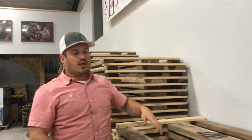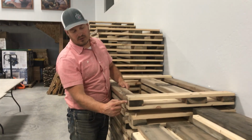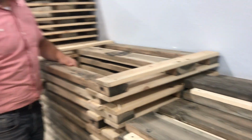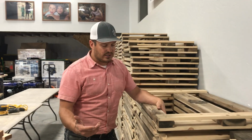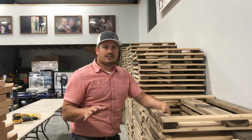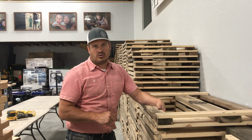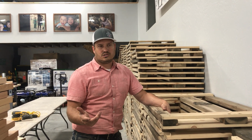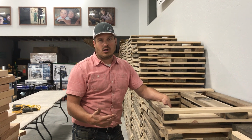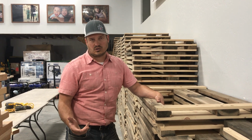Okay. The other thing I would do when you stack these is, you can see here I put the dowel hole screws out so I can see them. That way, if I'm walking by or I'm ready to do a delivery, and I come by and I don't see that hole is drilled out, then it instantly flags me, letting me know that I probably need to see if that dowel hole needs to be drilled out. You don't want to show up to a delivery and you don't have your dowel holes drilled out. You got to drill them out in the room. Creates all sorts of sawdust.